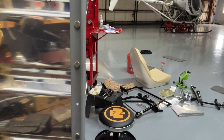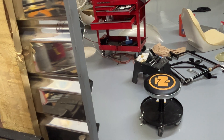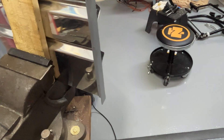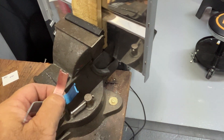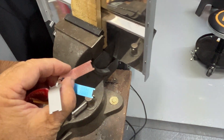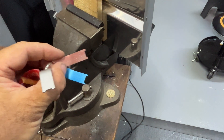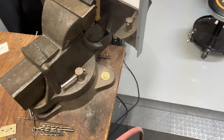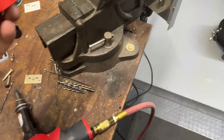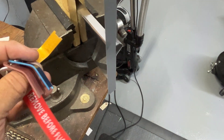For those of you who haven't done this before, you might consider getting a rivet go/no-go gauge — a number of companies sell them. Here's what they look like; you just put it over top of the rivet to see if you've got it mushed down far enough. We're going to look at the one-eighth inch rivet — that should be the gold one. Yes, one-eighth is the gold one.